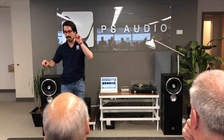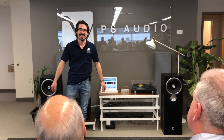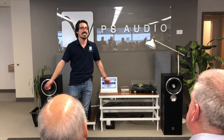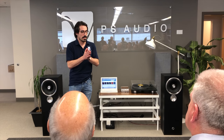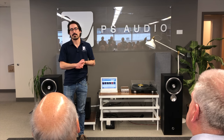Also cost. I mean, 700 parts. That means that we have to lay 700 parts. Every op amp that would be one insertion is now 40 insertions for just transistors. And then it's like 20 to 30 resistors and all that. So it's a big deal. It really causes your production to be complicated. But it's all about the sound.